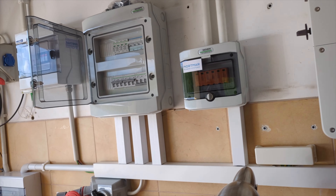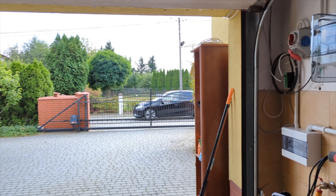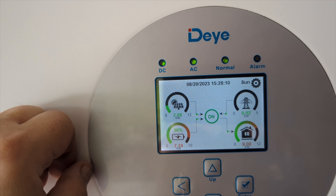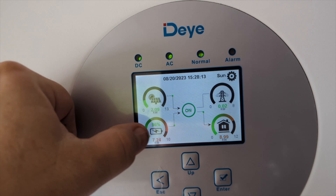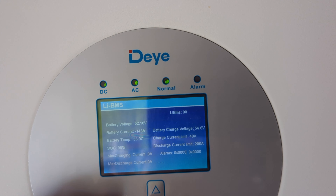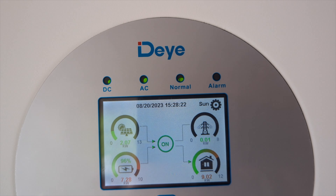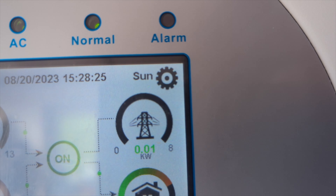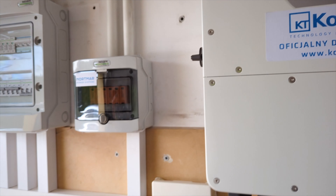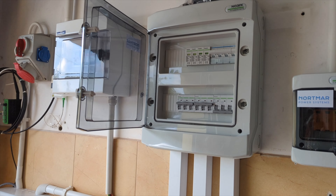The batteries are just filling in the missing power. The sun has set and the power consumption from the energy storage immediately increased. We're now in regular on-grid mode, getting 2 kilowatts from the rooftop panels and over 7 kilowatts from the energy storage. In our experiment the house draws a total of 9 kilowatts across three energy consumers, and from the grid the inverter is only drawing 20 watts. I will now disconnect the power supply to see how the inverter behaves when there's a power outage with such a significant load.